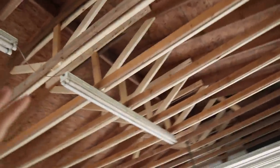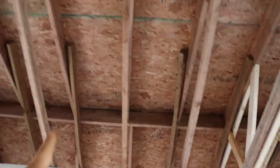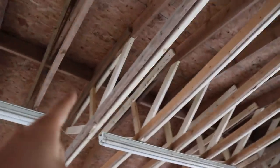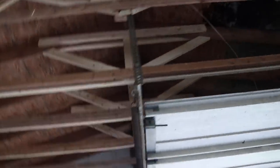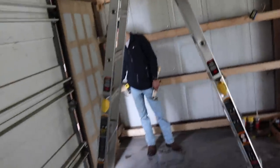Now I'm going to get to continuing with rafter or truss reinforcement. This is what we've been working on — all of these trusses had nails popping out of the two-by-fours at the top, the collar ties just popping out, and I don't like the idea of that. What we've been doing is completely reconstructing them, sandwiching them, putting in some 45-degree cut pieces for structural support, basically trying to make it as strong as possible so that the roof does not continue to sag down and cause any issues.